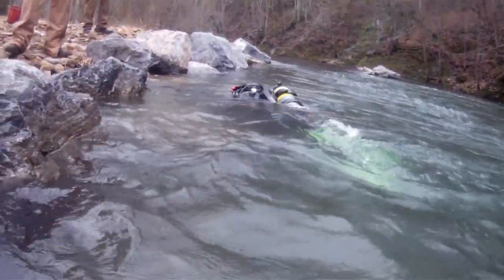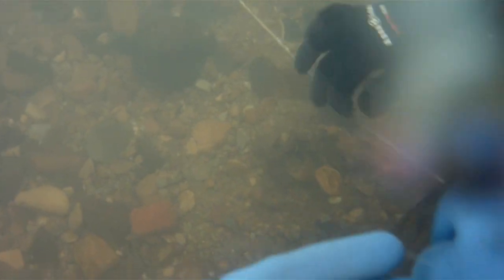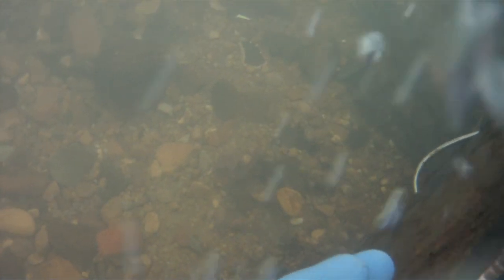Now that we've got them off, we're going to do a quick little clean-out of the intake — just at arm's reach, just as far up in there as we can reach. Once the current calms down, this is something we can come back to at a later date and reach up in there with a rake or some type of system to pull all those rocks out. We actually asked them if they could back-flush this system and they said they couldn't. So we've got to reach up in there and clean it out the best we can. For temporary purposes, now that we've got the grate off, what we're going to do is replace the metal end cap over it — just to keep any major or large critters out of the intake. If we leave it cracked just enough, they should still be able to utilize the intake somewhat. We got at least an arm's length worth of rock out of there — it was packed full. So hopefully they'll be able to use it temporarily until we can get back down there and reinstall another grate for them.